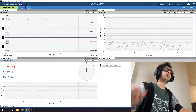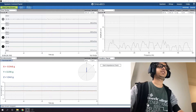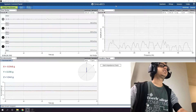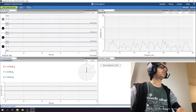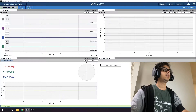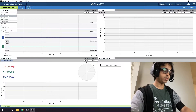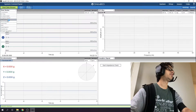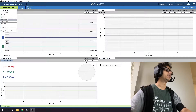This is my current setup. They also provide an open source GUI as you can see on the screen. This GUI provides an FFT plot, time series analysis, and some additional features. You can see here: time series, FFT plot, and accelerometer. Another feature of this board is that it provides accelerometer values, and we can do networking — for example, we can do an FFT transform and send it serially over a serial bus to wherever we require.